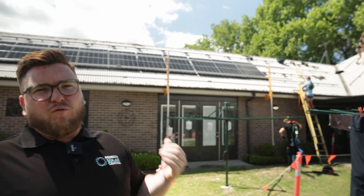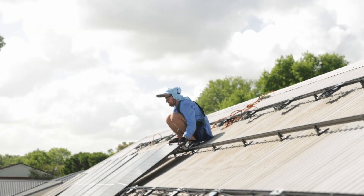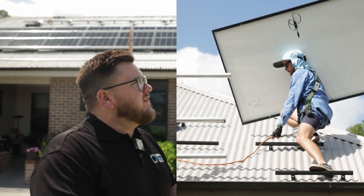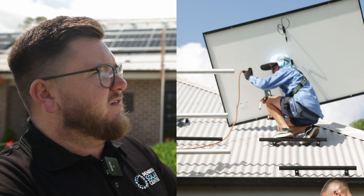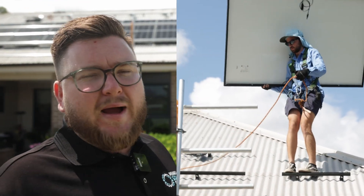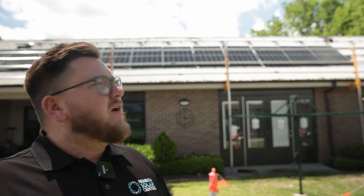This is a particularly difficult roof to work on. Right now we're about to throw panels on one of our roof faces, and in order to do that safely, the guys will actually build rail on the roof as a step. You can see they're in harnesses right now, just outside the edge protection. They're going to build that rail on the roof, which will act as a step for them to safely catch the panels and lay them.